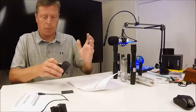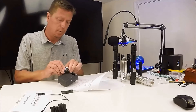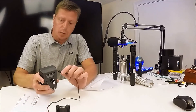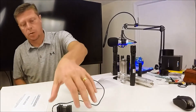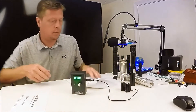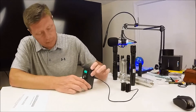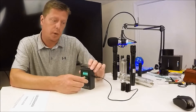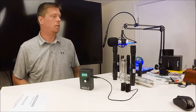I recommend you put in a new nine volt — don't take one out of your smoke detector, just get a new one. We got the nine volt in and we plug it into the side to power it up. Never touch the middle sensor — that's where we shoot to get the milliwatt reading. The oil and dirt from your hands can wear out the surface. Let it sit and acclimate to room temperature, and we'll zero it out if needed.